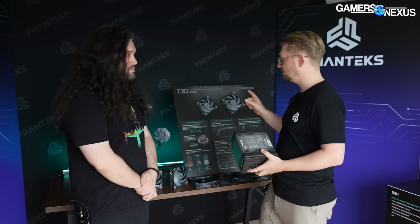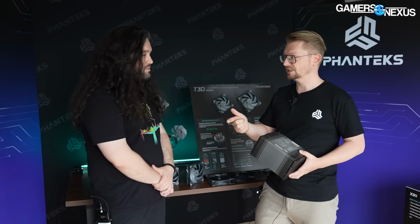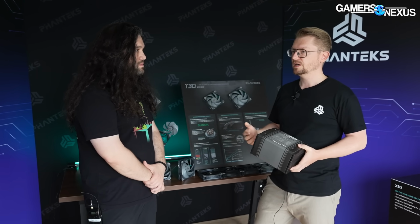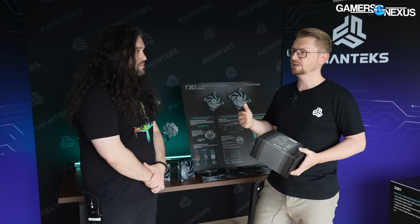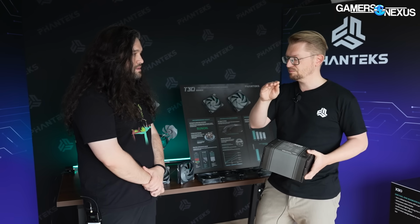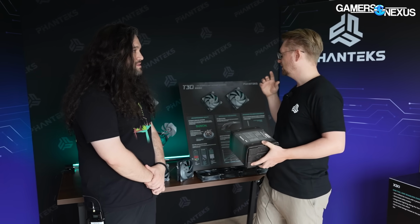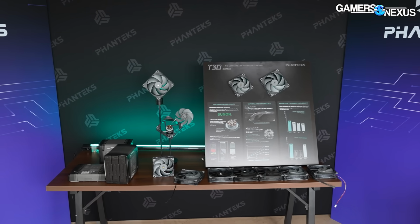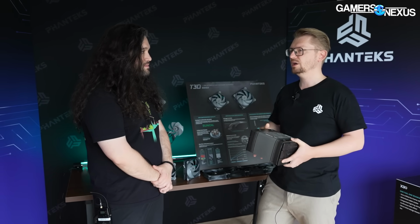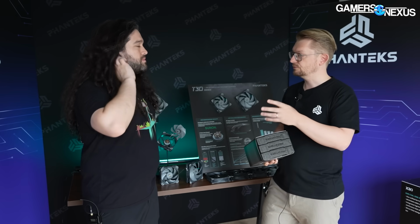It's pretty close. Our T30 120 used to be really close to our 140 that we took all the way to tooling, all the way to the finish line, and then it just didn't feel right. That's not what you would expect. So we went back and figured out, you've got pressure, you've got airflow, but the air has a direction. With an air cooler, you've got the flat tubes, the folded fins, and it's like blowing at an angle and trying to get it through a straw. Right, that's what you're trying to do. Then we started from scratch, and we really wanted to guide the air to that straw inside every radiator. That's what we aimed for, and it means you also have to give up something else, right? You can't have everything. And we really focused on the hard part for a 140 millimeter fan.